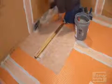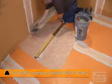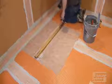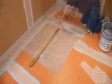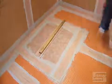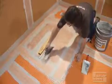Apply unmodified thin-set mortar using a 1/4 by 3/16 V-notch trowel or the Schluter-PROCUT trowel. Solidly embed the KERDI band into the mortar to ensure proper adhesion and to remove any air pockets. Repeat this process with the KERDI band waterproofing strips along the shower tray, ensuring that all seams are overlapped by a minimum of 2 inches. The same method is used to connect the KERDI collar on the channel body to the tray.